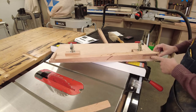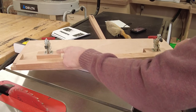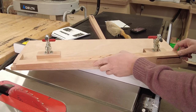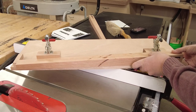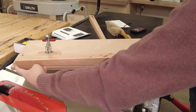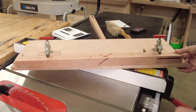For the second taper, I roll the leg so the other mortise side is facing out and push it up against the stop. Because I made the first taper, the leg has dropped down a little lower in the jig, so I need to raise it up so the clamp will actually hold it down, and also because the widest part of the taper looks better when raised. I keep my thumb on the leg so it doesn't move, then take the piece I cut off and stick it underneath as a shim, pulling it toward me just a little bit. Then I clamp it in place and we're ready to make the second cut.